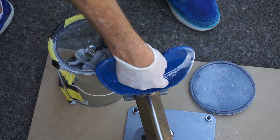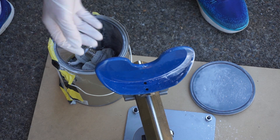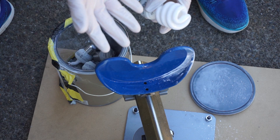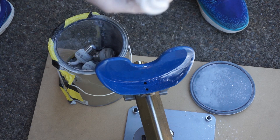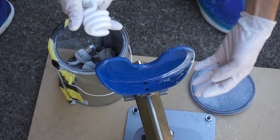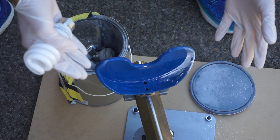So you can see this white powder here. This is the phosphor that came off of the coating of the bulbs. That's used because inside there's a mercury vapor and it ionizes to produce UV light. But that's not very helpful because we can't see UV light. But this phosphor coating, when it's exposed to UV light, it absorbs UV light but then emits visible light.